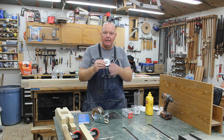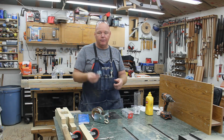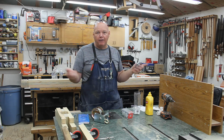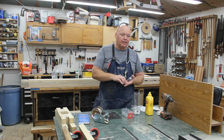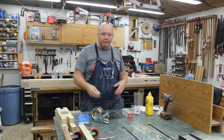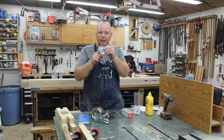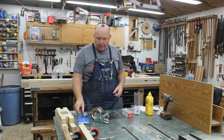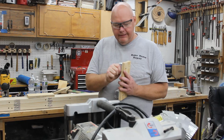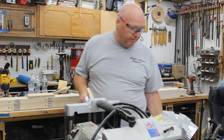You just need this, and then I went ahead and bought some 3/8 threaded rod. It was cheaper than buying a bunch of bolts, so I bought the 10-foot threaded rod and a couple of bags of washers and nuts to go on it, and I should be covered for any bolts that I need, with extra left over. You need a 3/8 bolt to be the axle for this pulley. So that's what you need for hardware, and then we'll get into the other components as we go. I'm working on making the trolley system that's going to go up and down the pole.